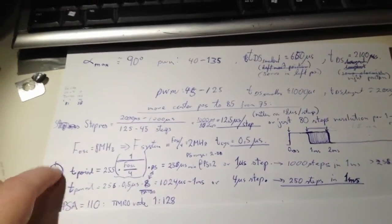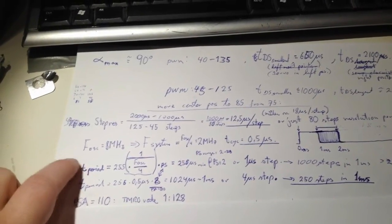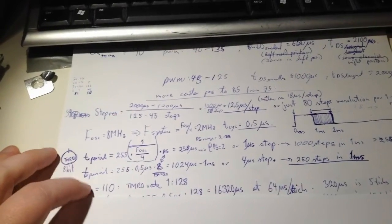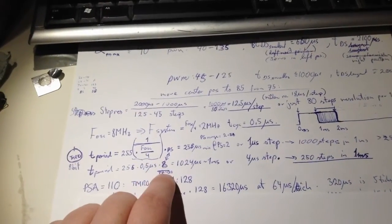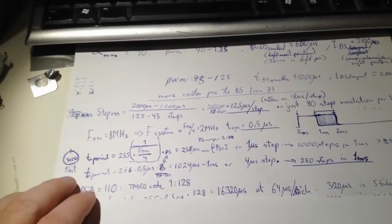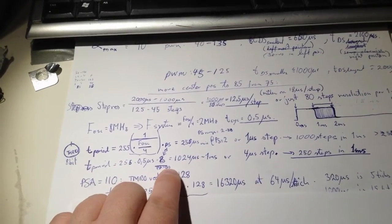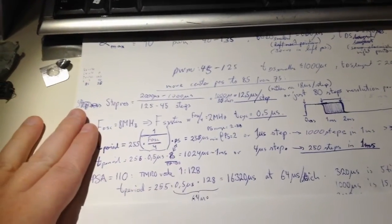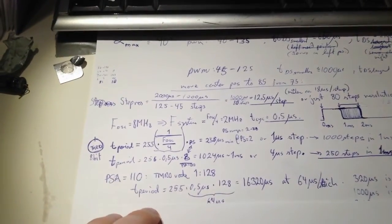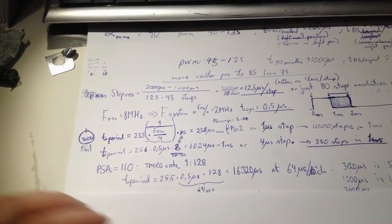We're utilizing the whole timer period here. So that's great. So I'm using the prescaler 8 setting on the timer, and I wrote that down. That's 010 in those bits in the INTCON register, or OPTION_REG. We'll look at that also.